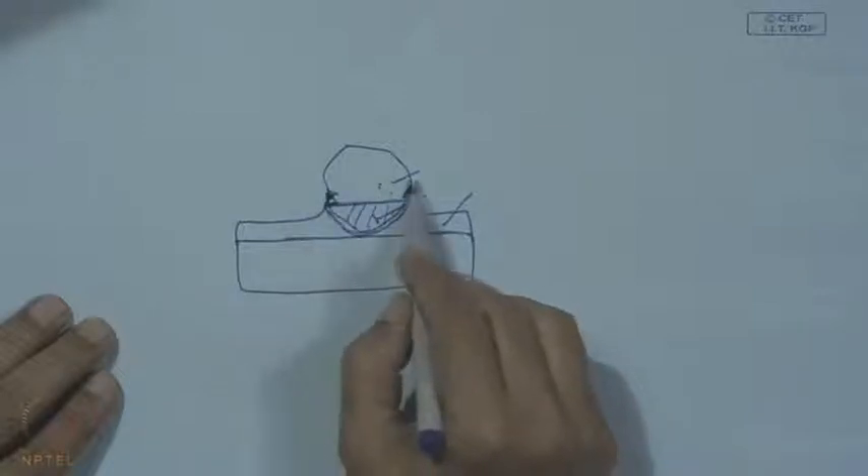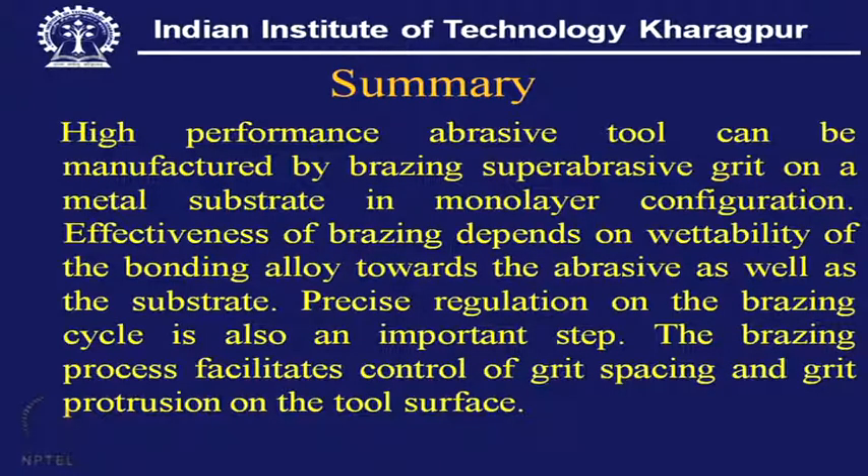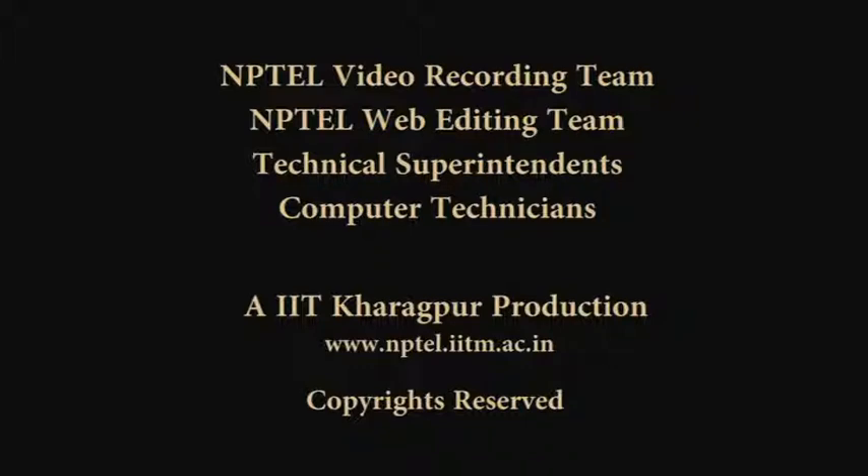This is the coverage of the bond, and because of crack formation, this part can be removed just because of thermal cracking. With all this taken into consideration, we can summarize: high-performance abrasive tools can be manufactured by brazing super-abrasive grit on a metal substrate in a monolayer configuration. Effectiveness of brazing depends on wettability of the bonding alloy towards both the abrasive and the substrate. Precise regulation of the brazing cycle is an important step. The brazing process facilitates control of grit spacing and grit protrusion on the tool surface.